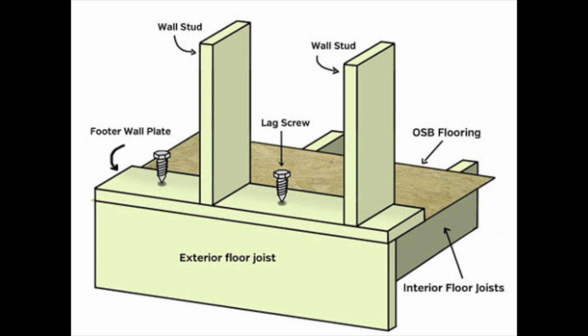So one mistake that sometimes people make with the resilient channel when installing it on the wall is with the baseboards. Sometimes when contractors are installing the drywall and the baseboard, they install a wooden block to reinforce the bottom edge of the drywall. If you notice that this is done, the drywall is now locked to the studs and the resilient channel won't be as effective, because if everything is locked, then you don't really have a decoupling factor anymore.